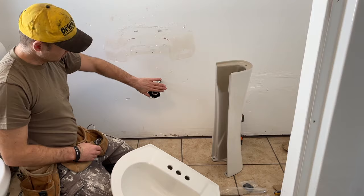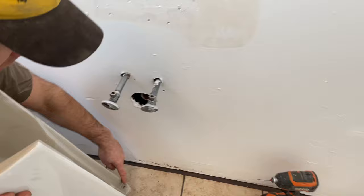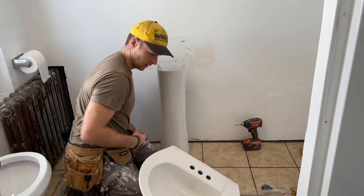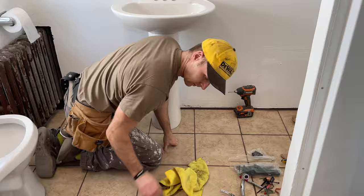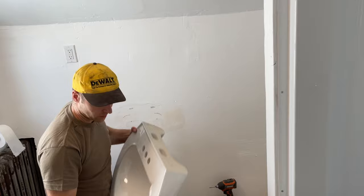As you can see, this is hollow here and these flat pipes could be a little shorter, but we're just flush enough. So we're going to line this up to measure where we have to drill holes — there are two holes. If you want to mount it to the ground, you drill and mount; if not, at least silicone around here so nothing moves. We've got two holes here to mark for the floor and up here where it connects to the wall.